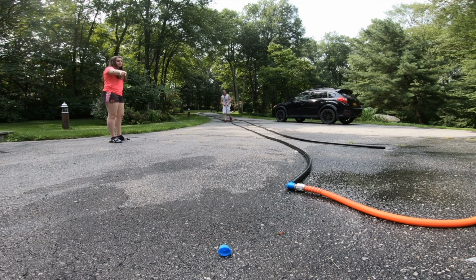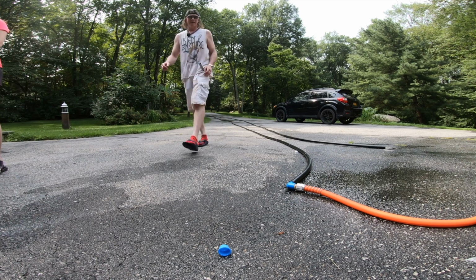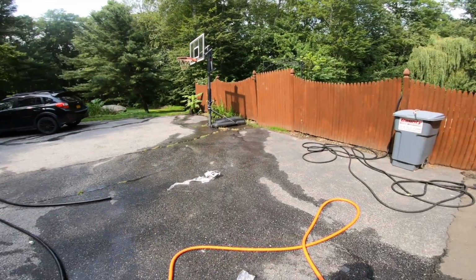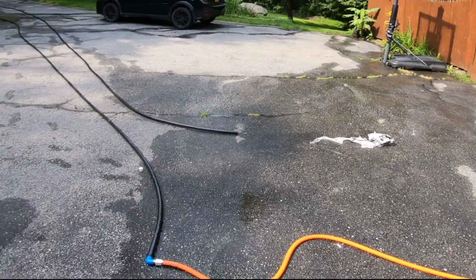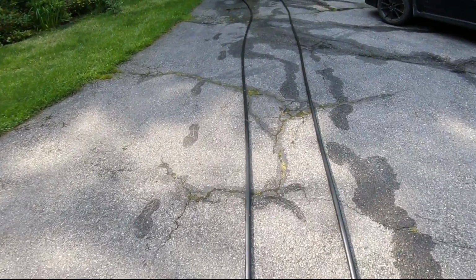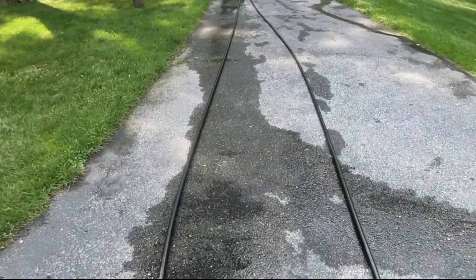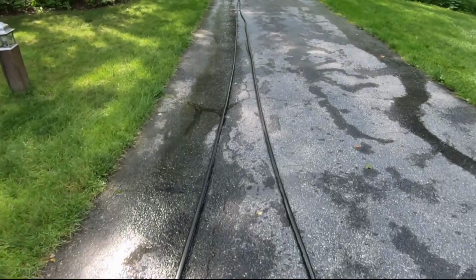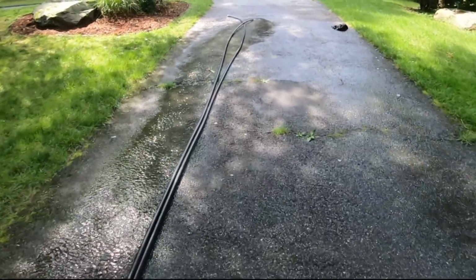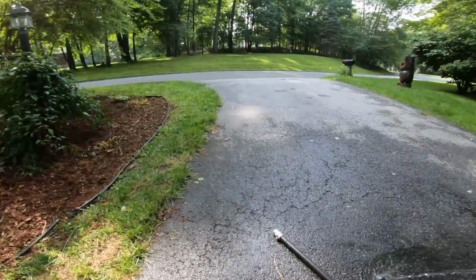So what this does is let you unravel it, and it actually stays where you put it. If you have really hot water and you kind of twist it and pull, this is what you wind up with right here. So there's the poly pipe. You can see both of them. There's the one next door to it. It's just sitting there right now. I believe there's still some water going through it, and it's hot. You can actually stretch it, and any kinks that are still in, you can straighten out.